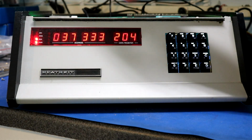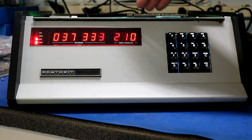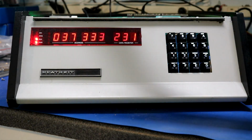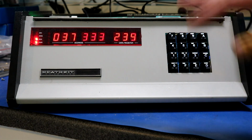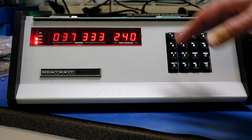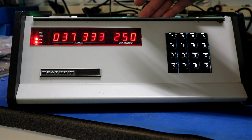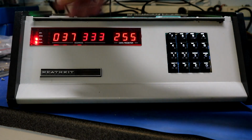If you see any flickering, and I don't know if the flickering will be visible in the camera or not, that's because it's doing, every 5 milliseconds, digit, digit, digit, digit, digit, digit, on, and then it cycles back. Occasionally it does some computation, and occasionally it'll check its keypad. But right now it's looking at the second byte of a 32-bit counter.